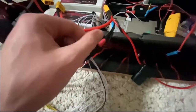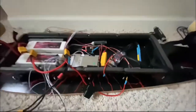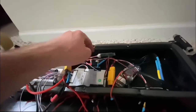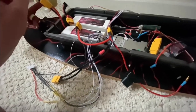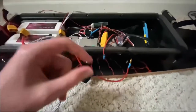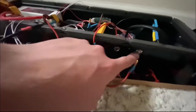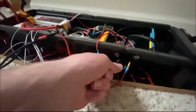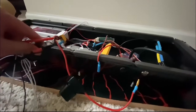I did put heat shrink on the exposed solder joints to cover some of them, and it was worth it because now they're all covered up and good to go. The anti-spark switch connects to the battery harness, and these little wires right here connect to the plug on the battery. Down here we've got the power switch and the charge port with a little cover.